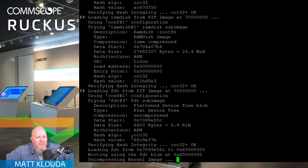Yep, I saw that. So that means that power is turned on to the port, but whatever's plugged into that port isn't drawing power from it. So most likely one of two things is going on. They didn't terminate the cable going to the doorbell, or the Keystone jacks are cabled incorrectly.